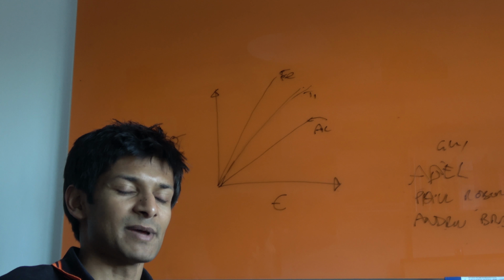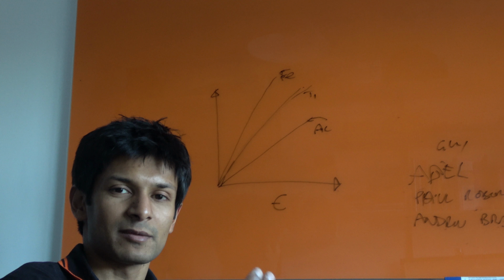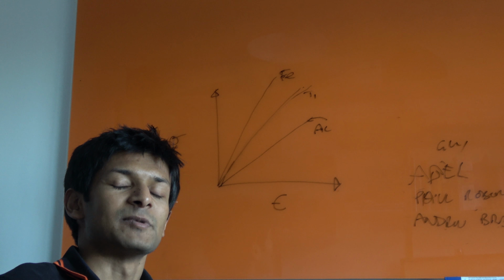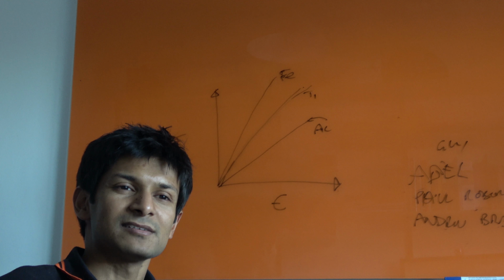So that Young's modulus makes a difference, because you can make the walls thinner, and if you can make the walls thinner, you can make your bottom bracket lighter. Titanium is slightly heavier than aluminium, so there is a design consideration to go in with that.